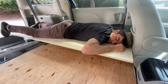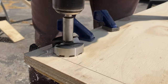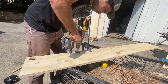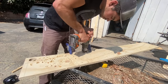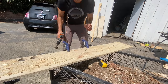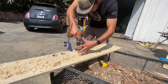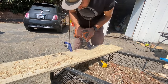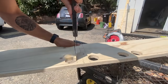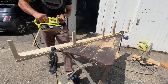When I woke up I took some more measurements, made some designs for the leading edge bed support, and started drilling holes where the corners of the openings were going to go. I used a Forstner bit with a backing plate to make sure I didn't get any tear-out and cut nice circular holes where each of the corners was going to go. These corners are measured to fit a specific size bin that the owner wanted to store her things in under the bed, so instead of drawers we're just going to slide bins in and out. After drilling lots of these holes, I cut out the openings where the bins were going to go and finished those cuts with a Japanese handsaw. This is probably an appropriate time to acknowledge that my workbench for the entire project was a wagon full of dirt — don't hate, it worked out just fine.